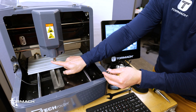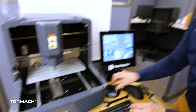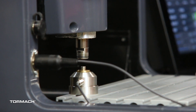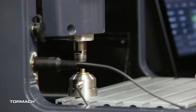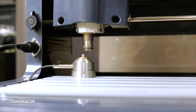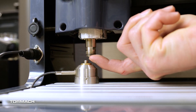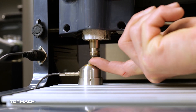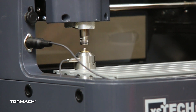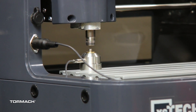We'll take the nut and collet completely off. We need to establish where this spindle is in space and the height of the spindle. So we'll go back to our tool and make sure the edge of this spindle lines up — I might go with my Z-depth just a little bit closer. Remember this spindle is hollow, so if I line it up perfectly in the center I'm going to keep going and it's never going to touch off. I want to make sure the edge of this spindle is touching the edge of that button. I'm happy there — next step I'll go back to my PathPilot screen.